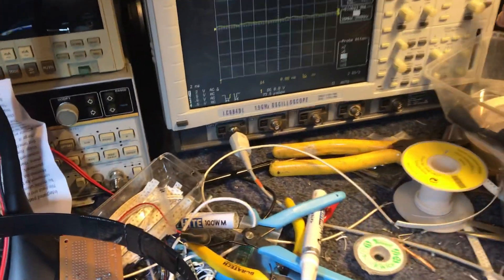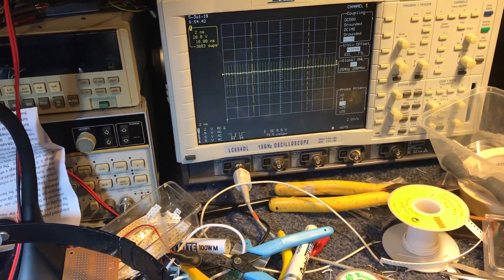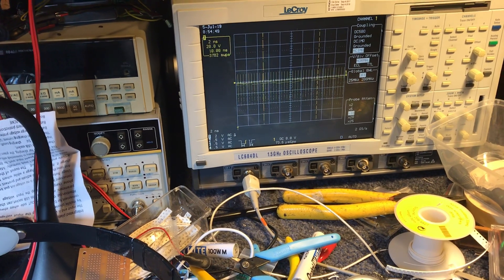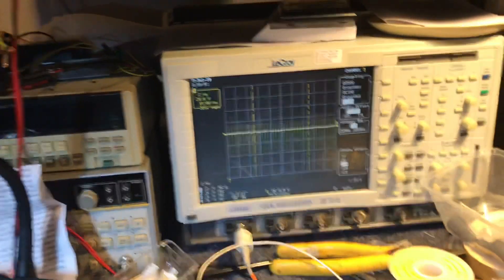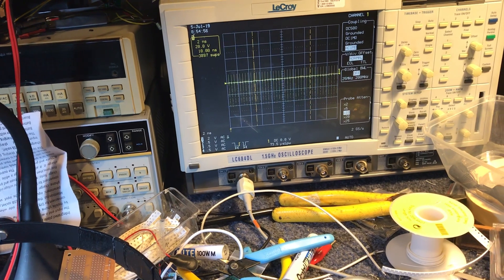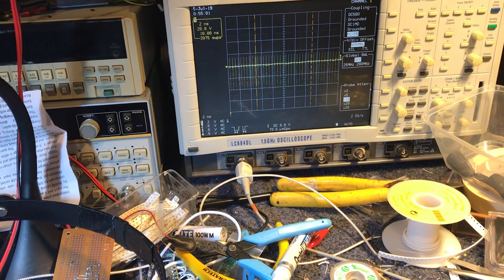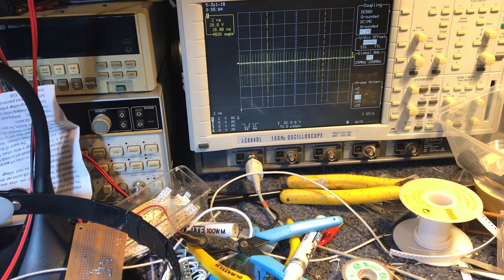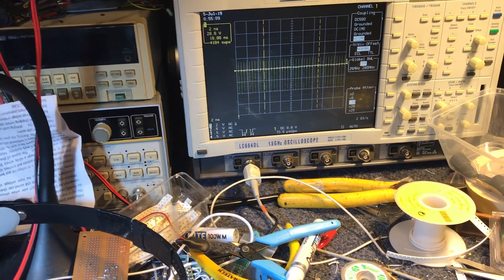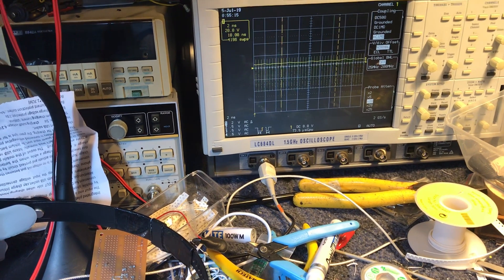I've adjusted the oscilloscope so it's resting at 185 volts on the center line, with 20 volts per division. I'll put on analog persistence so you can see any jump-ups held there on the little spikes. You can already see, with the detector just running, it has gone up to about 195 volts — just under that 20-volt-per-division line. These are very very fast transients.